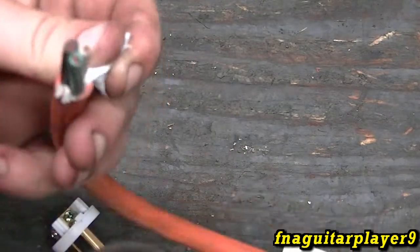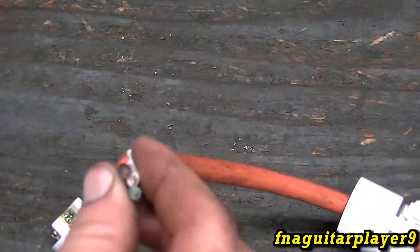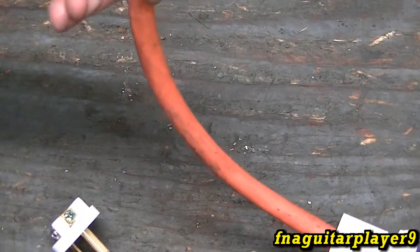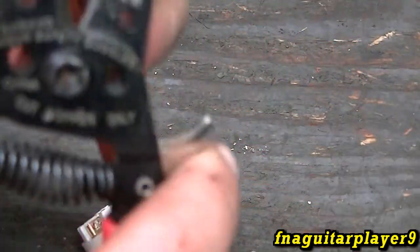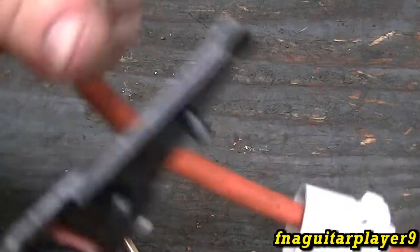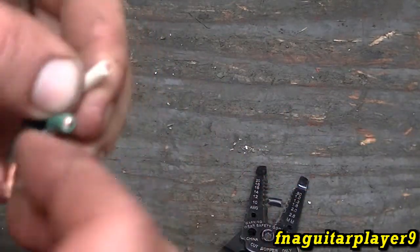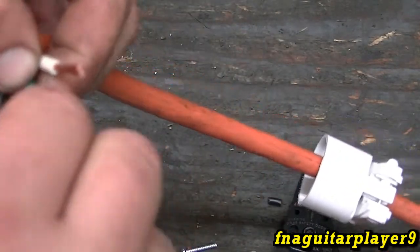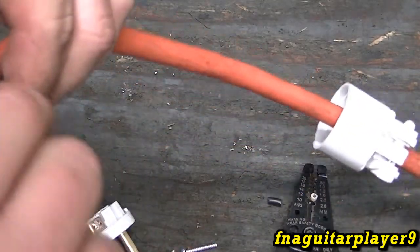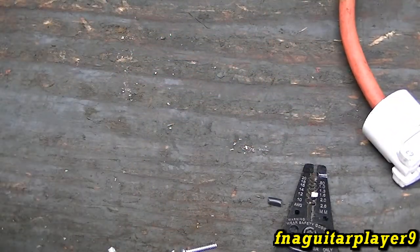It takes a little bit of practice. You want to cut all this insulation out of there — it's not necessary to have it sticking in and getting in the way. Now you're ready to strip the wires back. Your instructions will tell you the exact amount to strip back, but all you need is a little bit less than a quarter inch on all three of them. I always like to twist them to make it a little more solid and keep any stray wire from sticking out.